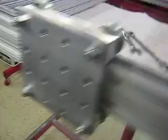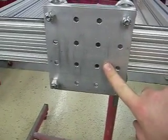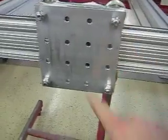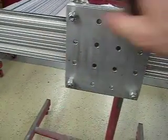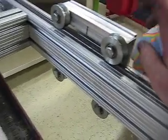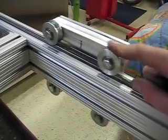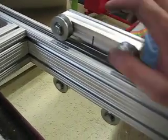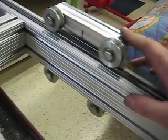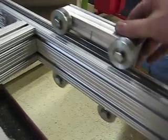Here's what I got — I forgot the number of this plate but it was an uncut piece. From the pictures you can see where I cut the ends off and then added these holes to it. This is one-inch square stock that my friend milled from some scrap aircraft-grade aluminum. These are the Butcher Boy V-bearings, which I got from Geeks Gone Bad. I'm basing my mill off of his concept.